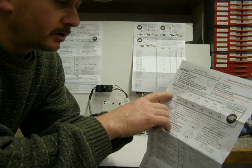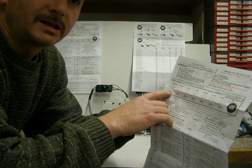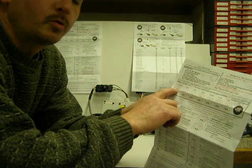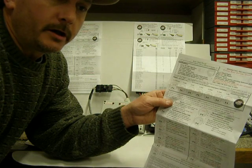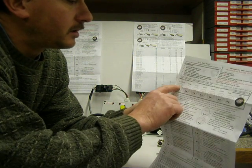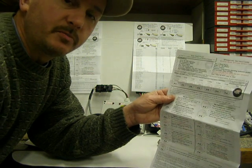The calibration is the number that comes into the auto feed. So let's say you have a magnetic pickup on a flywheel and you have 159 teeth on the flywheel. Your calibration number would be 159.0. If you were coming off of an alternator, let's say on a Cummins, and it was 15.6 pulses per revolution, you would set that number to 15.6. So that is how many pulses per revolution come off of the sensor type that you're using.